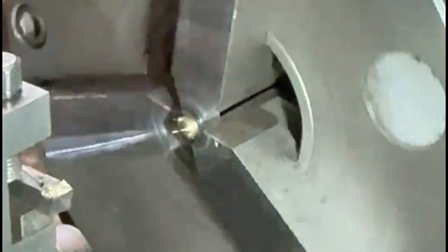Now I've put them back into the soft jaws so that I can machine off the front edge of the brass insert. I'm doing it in one operation — just facing off and putting a slight radius to break the edge on the brass insert so that it doesn't foul up on anything. That'll look quite neat; they don't look too bad actually.